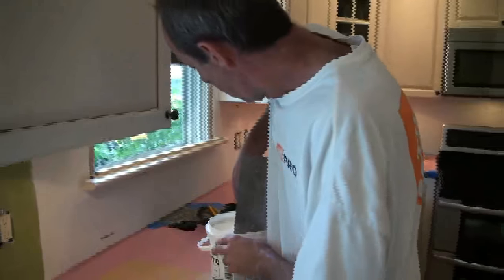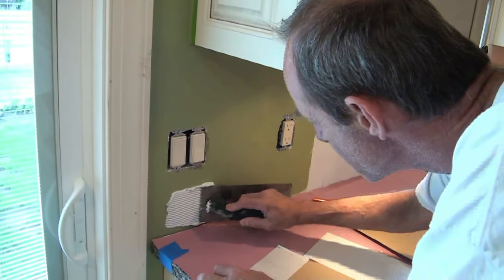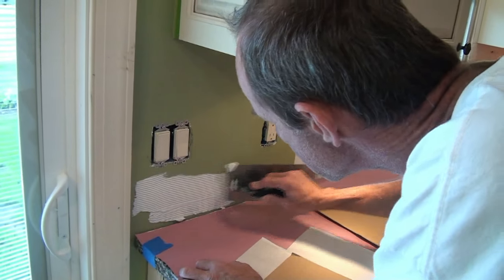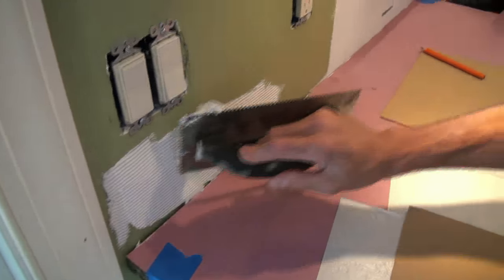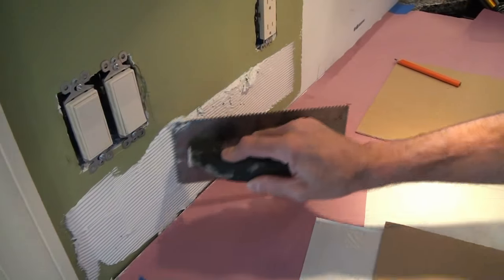Using a three-inch wide pattern on the trowel, just trying to pick up — you don't want to put down a whole lot more mastic than what you need. Spread that on there and let the trowel do the work. Once you spread it on, use the notches in the trowel to spread the thinset. It leaves these little ridges, and that also takes off what you don't need, spreading only what you do need. You don't want globs of this — it doesn't have to be a half inch thick. It should only be as thick as the notches in the trowel — about three-sixteenths of an inch.